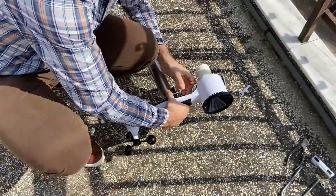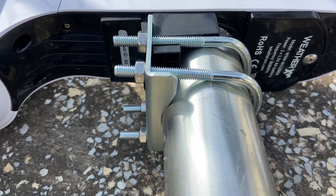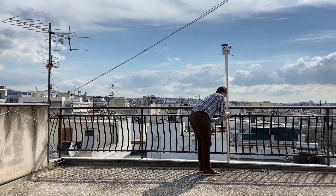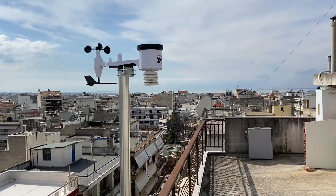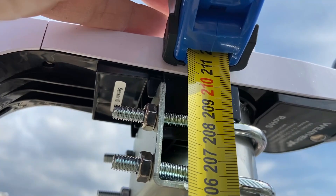The next step is to install the outdoor sensor outside the house. In this case I used the terrace of my apartment block. I placed it as far as possible from tall obstacles that could affect wind and rain gauge measurements, and mounted it on a two-meter metallic mast to avoid measuring artificially high temperatures, especially during the day. Hopefully the M5 gateway inside the house will now receive the measurements.